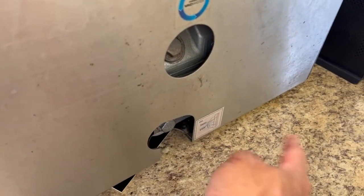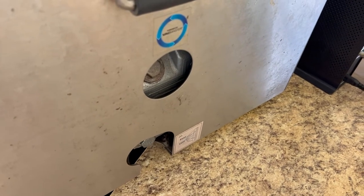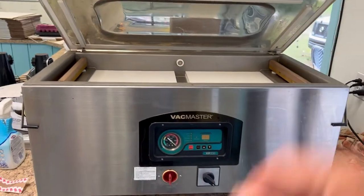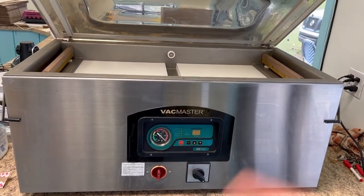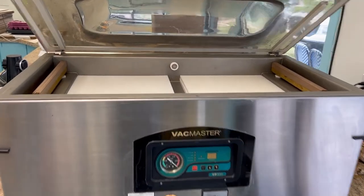I've never had an issue with it. If you overfill it, you're going to get some extra oil coming out of the back here, and that seems to be the only real consequence. So it might be a little bit better to overfill a little bit than to underfill and wind up with this thing smoking, because my homeboy has one of these things, didn't change the oil in it, and there was definitely heat and smoke and unpleasantness all around.